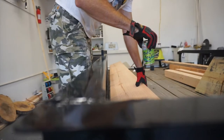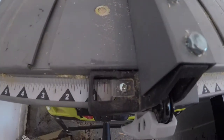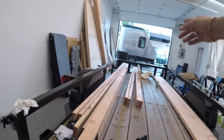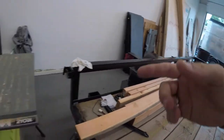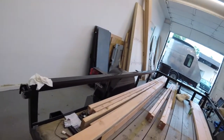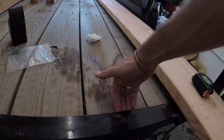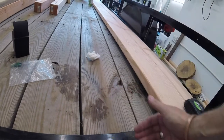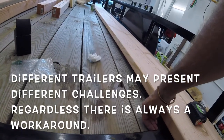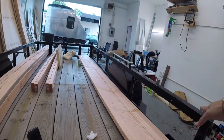At the table saw, set up to make the initial cut, I set it right here to five-eighths. We're going to send that piece of pressure-treated through there to cut basically a one-and-a-half by five-eighths thick piece that's going to go under that end. Now on this end it gets a little bit trickier because you have this lip here, so that actually raises the board. Since this board is going to end on the lip, you actually need to cover that distance as well, so that comes up to closer to an inch.